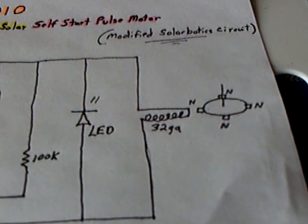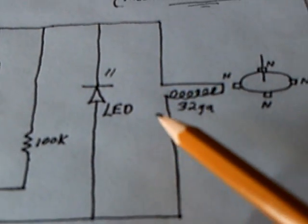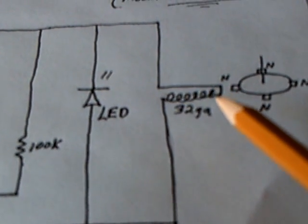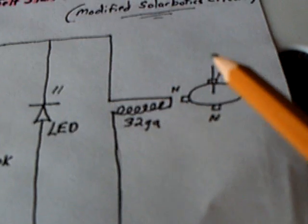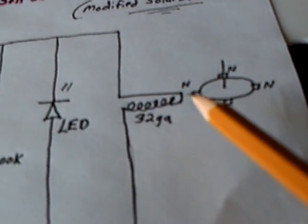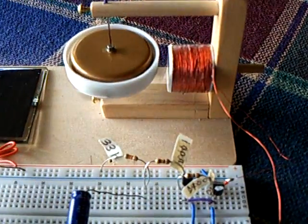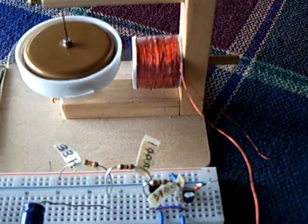The reason this is such a winner circuit — and it's better than the one I just posted — is that this will start pulsing at a certain frequency to start moving that rotor. But once it gets moving, there's a feedback through this right here that speeds this up. It's this feedback that is different than what I posted before.